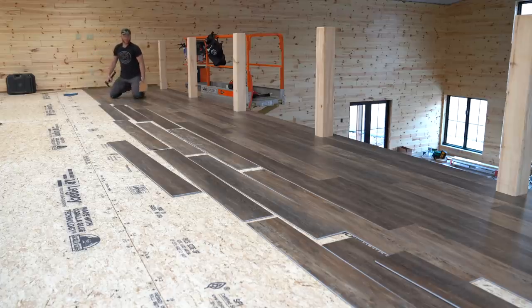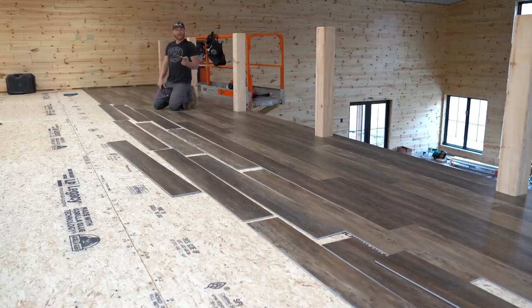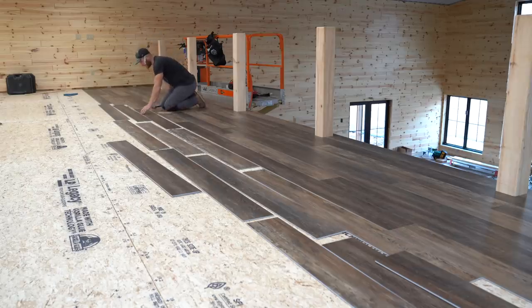Believe it or not, another thing is, back when we designed this floor system, I knew we were gonna be using a laminate floor, and inherently laminate floors can look really bad if not done well. And what I mean is not only the installation of the product, but the subfloor underneath of it. And honestly, that is why I really wanted to overdo this big area, this big 1200 square foot room up here, because I knew that you were gonna have all this sunlight coming in these windows, pouring across this floor. And the last thing I wanted to see was an uneven or wavy floor. And by using I-joist, Legacy, 1 1/8 subfloor, it should take out all of that and make it nice and flat. So I'm really excited to see the sun come across this floor.